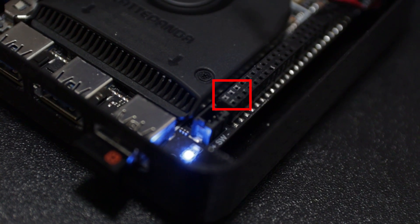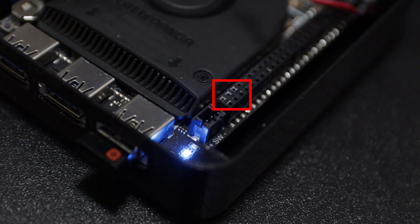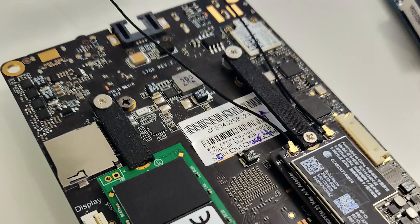As far as the lid goes, you can just lift it up from the back and it reveals the Latte Panda and the button. You have a lot of room on the left side to squeeze things in. If you don't have the connector for the power switch, you can use these six pins that have sleep one, sleep two, reset, power button, and the GPIO pins. For the M.2 PCIe slot, if you don't have the full-size slot I also created small rods that hold it in place. I'll have that on Thingiverse with links in the description.